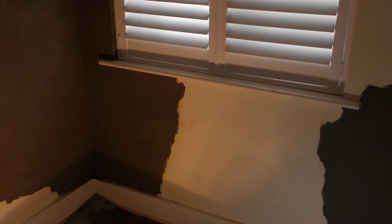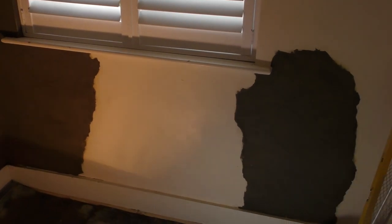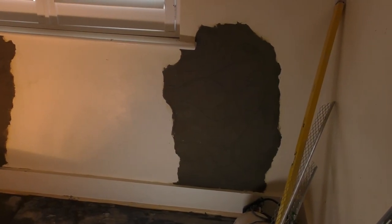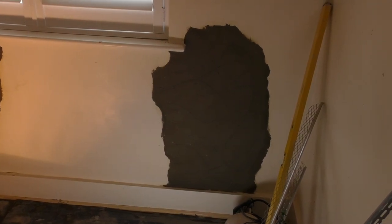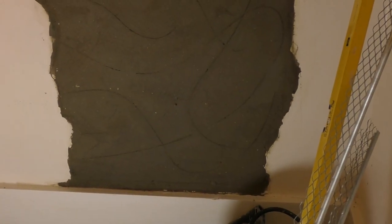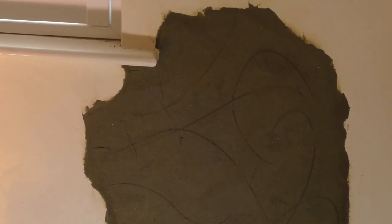You can see it's quite a large area, but it would have been pointless to take off any more than this because the rest was solid. Now you can see that deviled-up pattern - that's just from the devil float, which is the float with the screw in it. Too much sticking out obviously you just loosen it off a bit so it sets itself back inside the float.